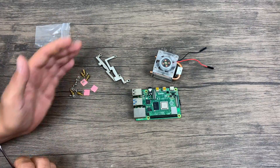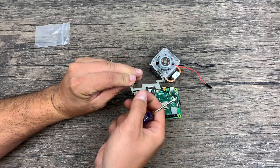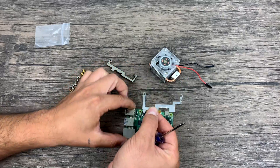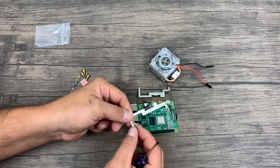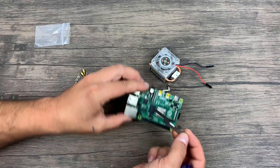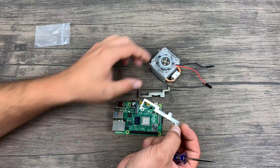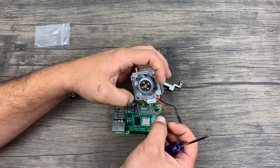So I'm going to be sticking with the included thermal pads for these tests. The first thing you want to do is grab the mounting brackets and just make sure you have the correct one for the left and the right side. They are not interchangeable — they only go on one way. You also want to make sure that the fan is facing away from the GPIO pins and towards the power end and HDMI. I initially assembled this with the fan facing the GPIO and I just can't access it that way, so I had to swap it out.